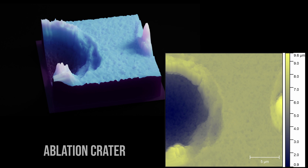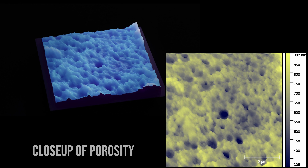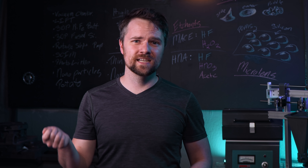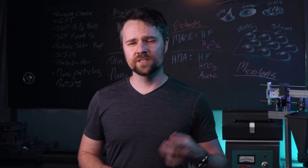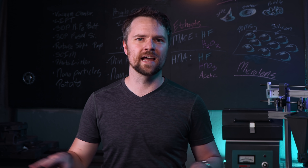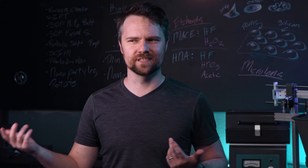This really confused me for a long time because there shouldn't be any chemical reaction happening outside the crater if the silver incorporation theory is correct. I backed up and thought about it, and it occurred to me that maybe this etchant does in fact etch silicon by itself — just very slowly — even with no metal catalyst present. I tested it: take a clean bare piece of silicon, throw it in the etchant and leave it overnight. Sure enough, I got a very similar result — lots of porosity all over the wafer. So what that leads me to believe is that the original smoothing effect was just a generic isotropic etching behavior, and the silver was somehow acting as a mask and preventing the etchant from touching the silicon under it — the opposite of what it was supposed to do.